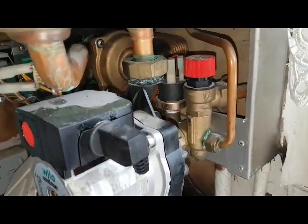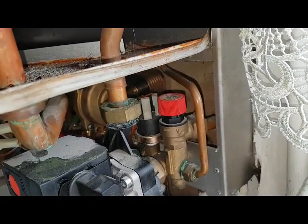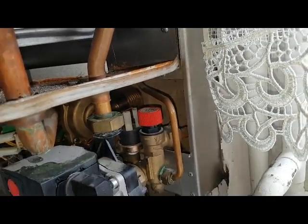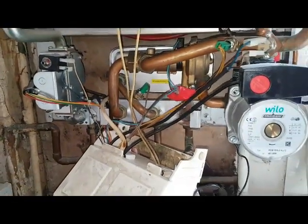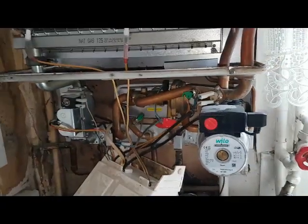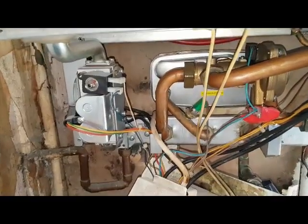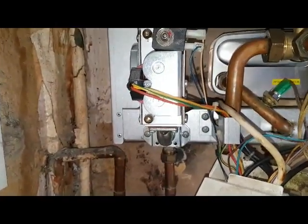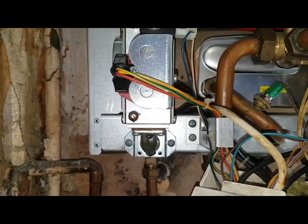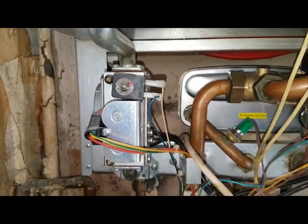There are also safety controls on this boiler. You've got your water pressure switch — if the pressure's too low that will kill the boiler. You've also got your PRV. This is a standard efficiency boiler. For gas portfolio people doing their training: on your gas valve the inlet is at the bottom and the burner pressure is at the top — so that's for you.